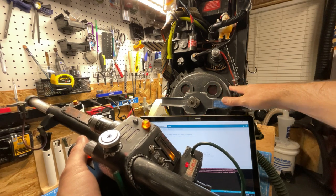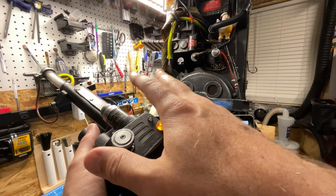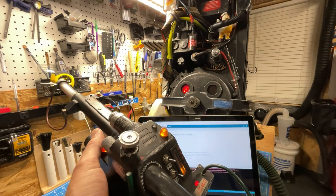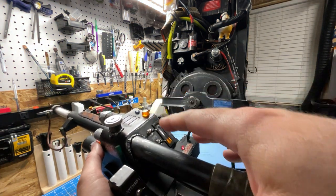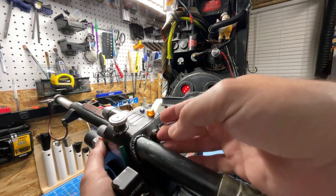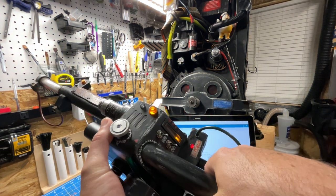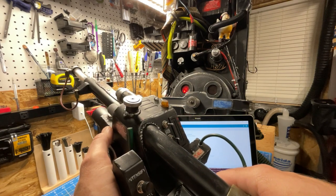So at the most, we're powering all the audio built into the wand. We're powering the wave trigger, but we don't have enough juice to power the speakers. So this is a nice way to do a quick bench test, just to make sure that the wand and the pack are working correctly, by basically leaving it plugged into USB power. And you can flip your switches, double check everything works, and we're good in this case.